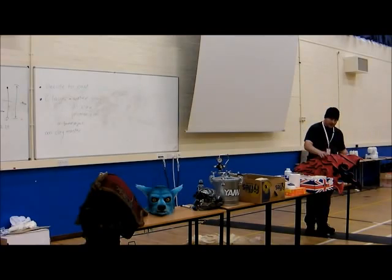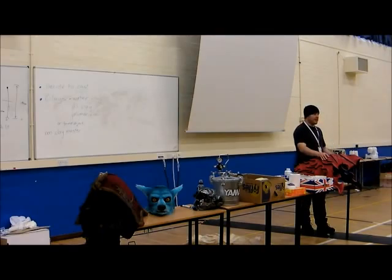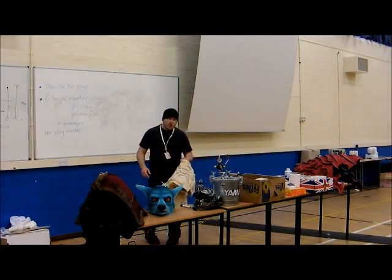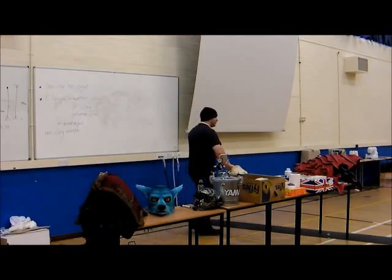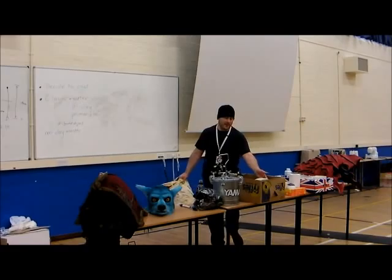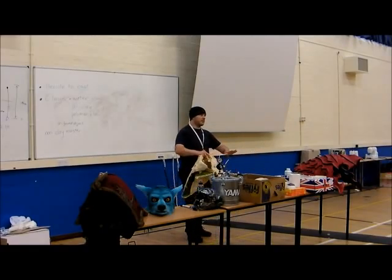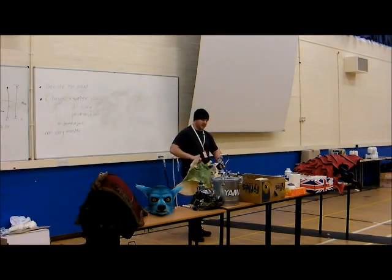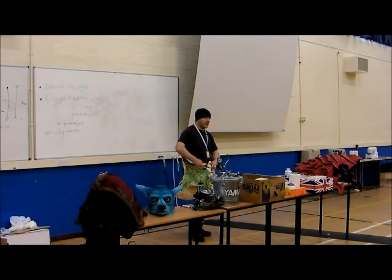Right, so this is a cast in fiberglass. So what I've done is that mould originally had, stupidly, a plaster of Paris, just like the lion face, plaster of Paris bandage, mother mould, which that sat in. I then actually pegged it to the edge just to hold it in place, because it is still a little bit flippy floppy. And then I just laminated fiberglass in.